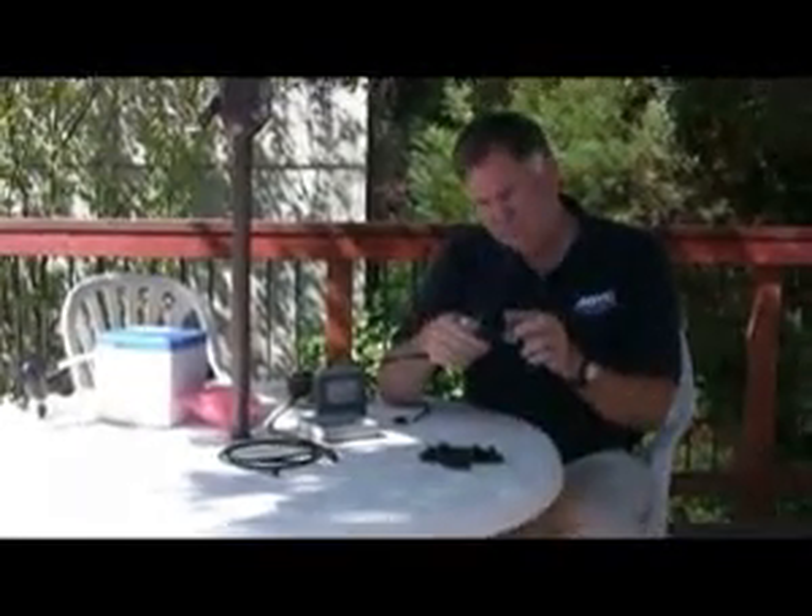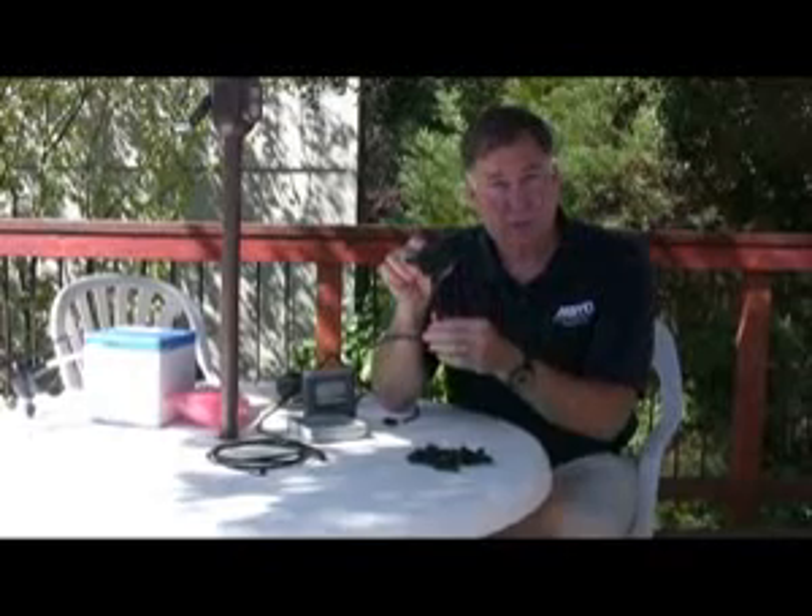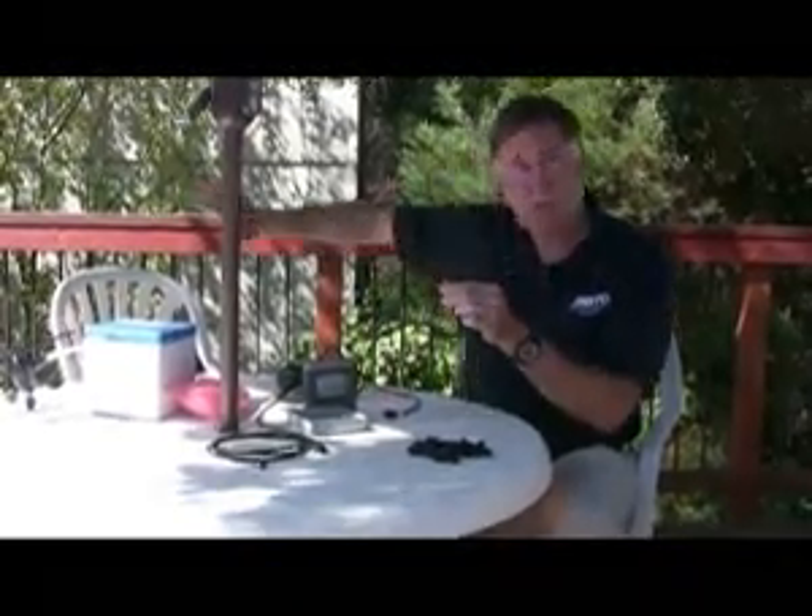I've got a display but nothing connected to it yet. I recently bought a 21-foot Zodiac with some other guys from West Marine, and I want to measure fuel flow to find the most economical speed to run at. This is the Garmin fuel flow meter, designed to be mounted in the fuel line. You take off the protective plugs, cut the fuel line, stick this in place, put some hose clamps on, and you're ready to go. It has two cables — one for power and one for NMEA 2000. Some sensors are powered entirely by the NMEA 2000 bus, so you'd only run one wire. Because this is also in an explosive environment, the connectors are located 20 feet away at the end of the cable so you can make connections away from the fuel system.